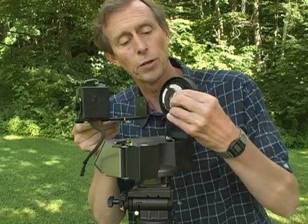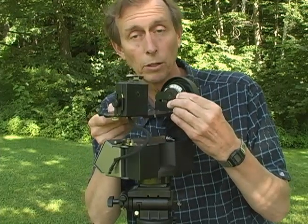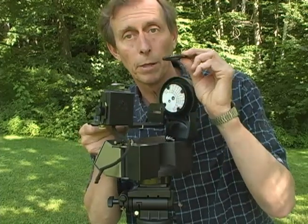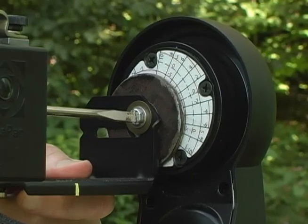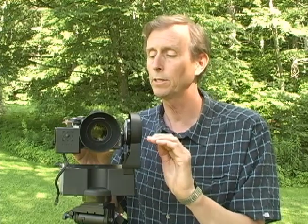If a spacer is inserted between the motor plate and the camera tray plate, the whole camera tray, including that button pusher, is moved over a few millimeters. This is a 3 millimeter thick washer. This requires replacing the thumb screw with a slightly longer screw. So now I can mount a camera with a lens with a barrel diameter up to 76 millimeters so that it's aligned perfectly over the lower motor with the center of rotation of the tilt motor.